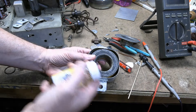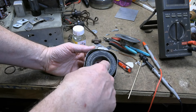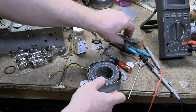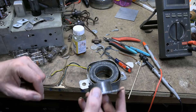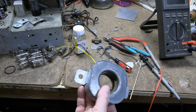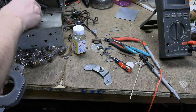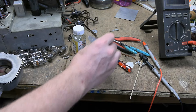Things are coming back together nicely. I had the corona dope out, so I might as well use it on everything. I coated all the interior surfaces, put a layer on the coil, then wrapped it in kapton tape. Now I'm putting it back together. Before I seal it, I'm going to make sure it still works. I also need to reattach all the hardware to the two ears, and get the springs and screws all back together.